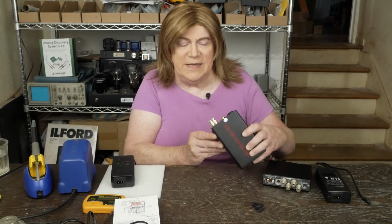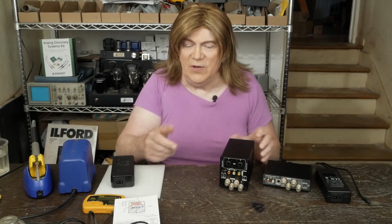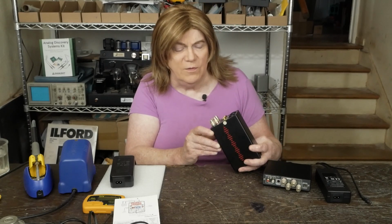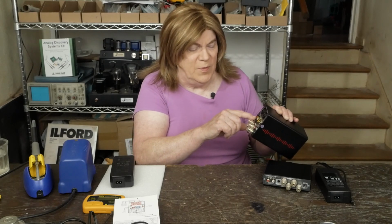The other thing it has is a switch that's a 3 dB boost on the RCA. And I guess if you have a weak source, the old mini plug terminal on your phone that you're going to this, or off a laptop or something that maybe doesn't have a lot of drive, it's got a boost switch, which I didn't need to use. And then it's got a 12-volt trigger, which I'm assuming you could use to turn on other equipment. And then it's got a low-pass filter adjustment from 150 hertz to 600 hertz. And we'll talk about that more in a minute.